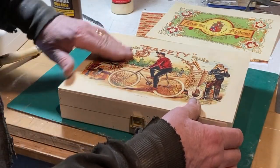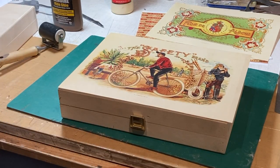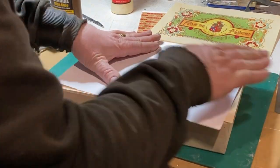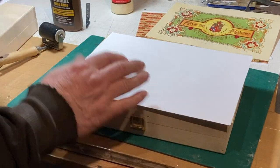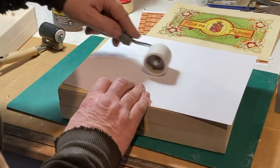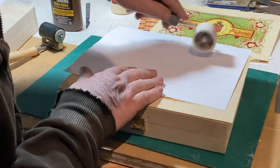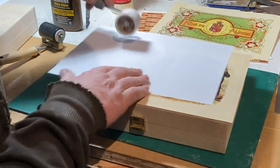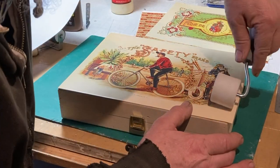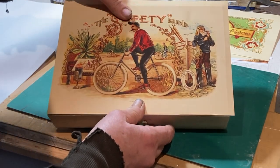Just steadily work that up. If you get this wet and rub it you will abrade the paper, so the best thing to do is to put another sheet of paper on top and just rub that down ever so gently. Then you can take another clean roller. If you've got any wrinkles or bumps you want to work from center to the outside. Be careful working around the cutouts — you want it rolled down to the edges but you don't want to force it into them.